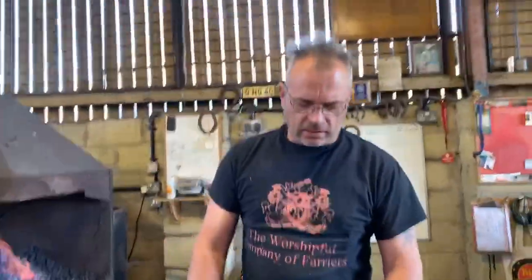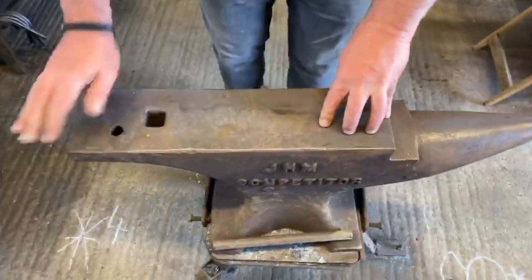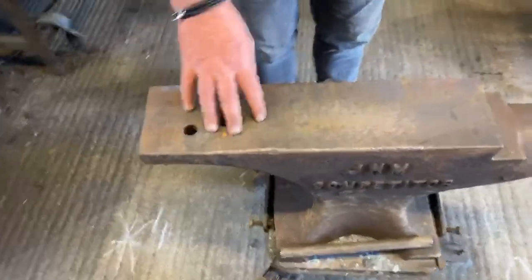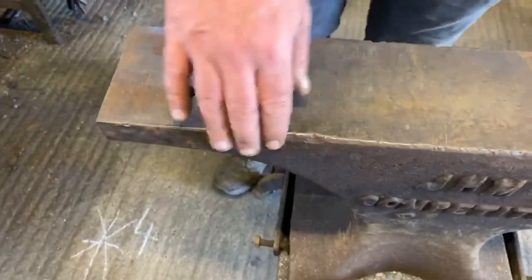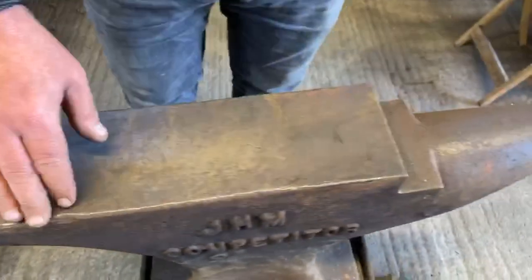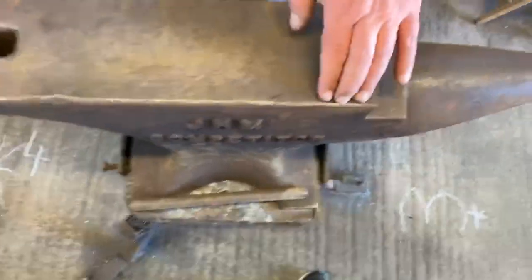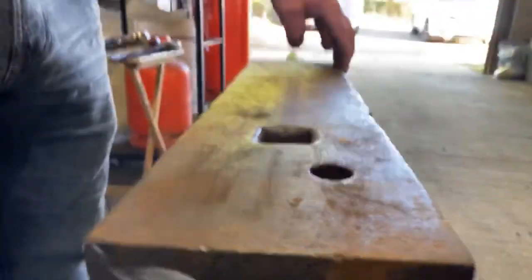Lastly, and the most important tool of all, is the anvil. There are things on the anvil we need to use, and it needs to be serviceable. Obviously with wear and tear over a period of time, we end up with broken, rounded edges on the anvil. They are no use when it comes to pulling clips. We need a nice, straight, flat, relatively sharp edge to pull clips.